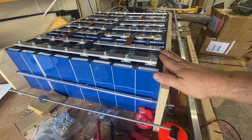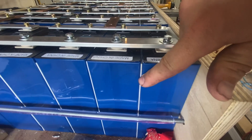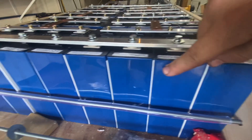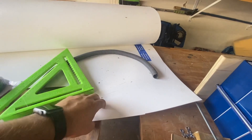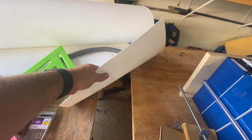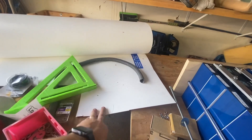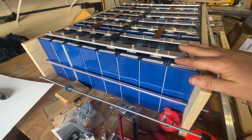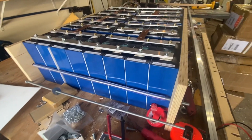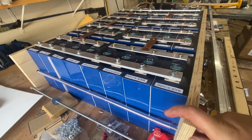With the compression, you may notice we're also adding a little insulation layer here because this blue plastic is not very thick at all. What I'm using for that — you can see one of them sticking out a little bit — is this material I got from Menards. It's like something you might use in a bathroom: just a four-by-eight sheet of plastic you can cut with a utility knife. It's really easy to cut. I just cut out all the pieces I needed, stuck them in between, and then compressed them. I did that before I took my measurements for my bus bars, which is probably what we should talk about next.